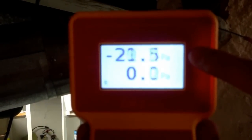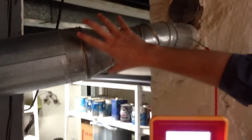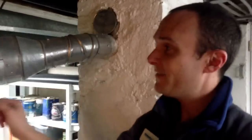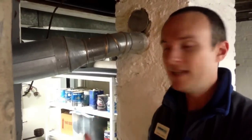That is a fantastic draft pressure. The reason it's so weak over here is because we're taking all of these combustion gases and squeezing them down so that only a little bit of them are getting into the pipe. The stuff that's left is coming out of the little opening over there. This is a common problem that you'll see in the field.